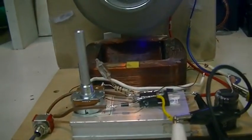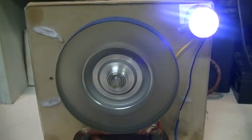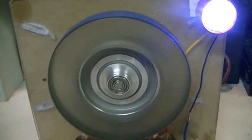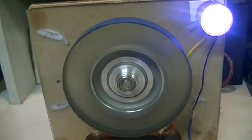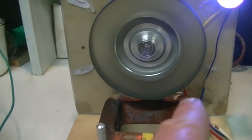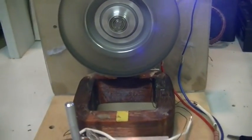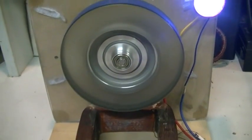I just thought I'd chuck my other rotor on — it's a fair distance away from our coil, but it's working extremely well. On the rotor we have magnets arranged so that as the north field is passing, the south field is entering, so they will be firing together, not separately. We're doing around 1,800 RPM at the moment.